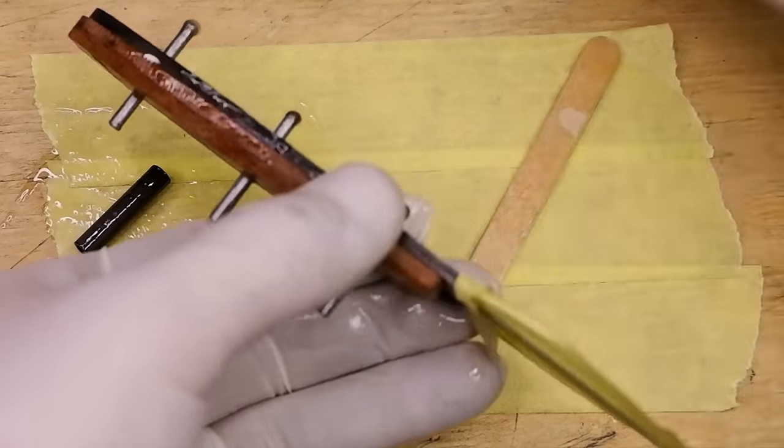Finish the handle with sandpaper, paying attention that both sides of the handle are symmetrical. Work it up to 800 grit to bring out the best the wood can offer. A little boiled linseed oil will really bring the wood to life and reveal the beautiful grain structure.